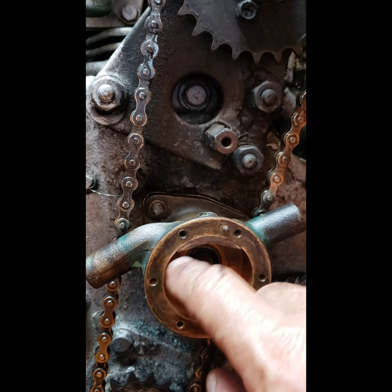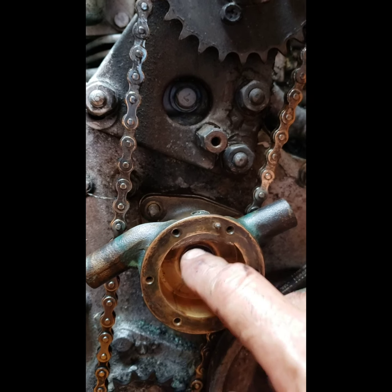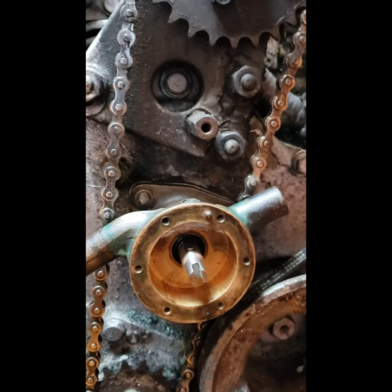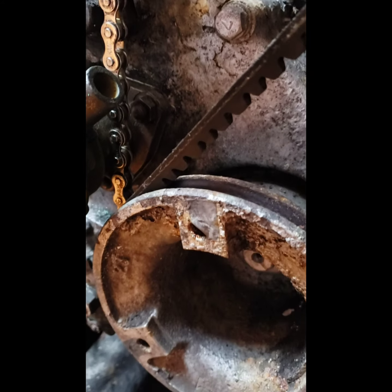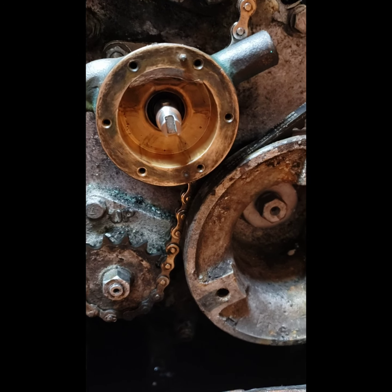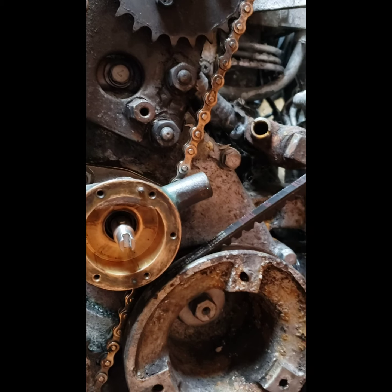But I know the cam is right up here, and when I took the raw water pump off, when you look at the impeller, you see the blades of the impeller are kind of smushed one way or the other, and that's because of this cam. So that made it easy to know exactly which position this went back on the motor. Okay, I snugged all 3 bolts down, and then I torqued them a bit. So I should be all set to put the impeller in, the gasket for the impeller cover, hook the hoses back up, and then start her up and see how she looks.